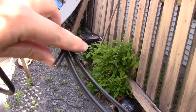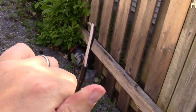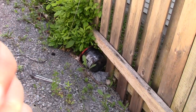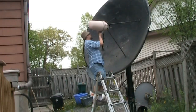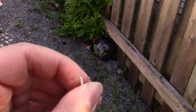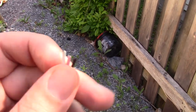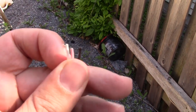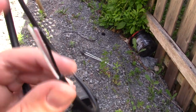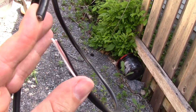So my redneck setup for today, I have these three wires here. These wires were for the old LNB on these dishes, for the old dish, Black Beauty, that I had here. When I got it, the LNB was really old, basically a power control LNB, or an LNA, actually it was an LNA, as someone corrected me on YouTube. So these three wires here, but I need an extra wire for my actuator control for the other dish, because I'm using two Super Jack power controllers.